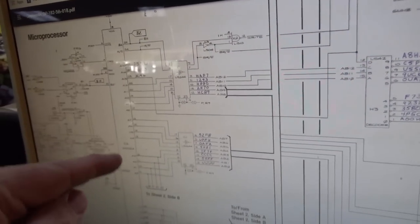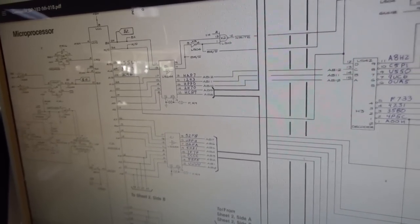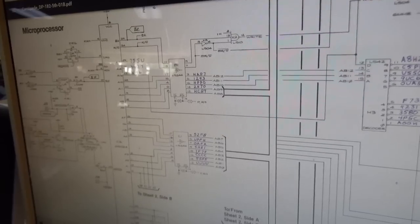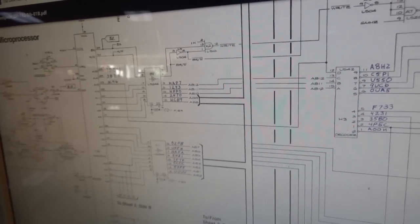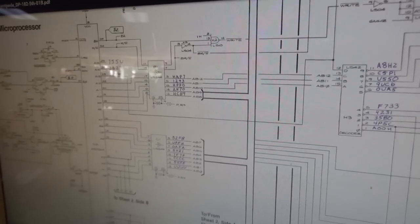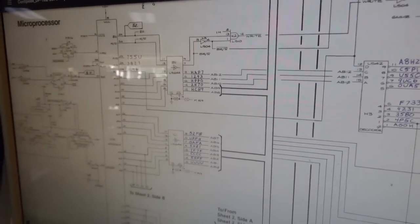So ultimately what's happening is the CPU is not running code. It's running into some kind of problems. So that is our signal there that the program is not running properly. Now we kind of already knew that because the screen's so screwed up, right? But since we're not even getting any noise, any sound, it's a static screen, there's nothing really going on, it's not running much code at all. It's not even running enough code to give us an error message. It's just the screen's all screwed up. So hopefully we'll get a little further along and then you'll see what I mean about the error message.